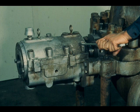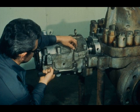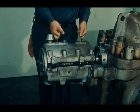Now remove the bolts securing the top half of the bearing housing to the bottom half. There are two tapered dowel pins, one on each side, which assure proper alignment of the bearing housing halves. They should be removed now, and this may be accomplished by tapping them lightly on the lower end with a hammer. During reassembly, each pin should be installed in the same hole it was removed from. The top half of the bearing housing may now be lifted and placed aside. Care must be taken to lift the housing half straight up and level to prevent damage to the oil seal ring on the inboard end of the housing.